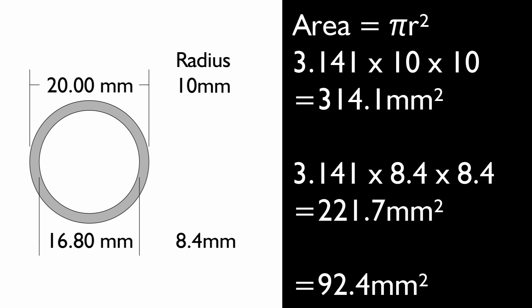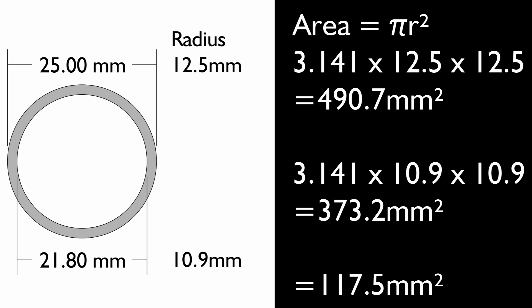So 92mm² — that is absolutely massive in comparison to the wires going inside, which are typically in the 4 or maybe 6mm² range. For the 25mm conduit, the same calculation gives an outer area of 490mm², with the hole at 21.8mm diameter giving 373mm², so the wall cross-section is 490 minus 373, which is 117mm². Once again a very large size, so it should certainly be big enough.